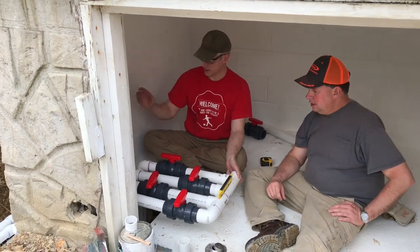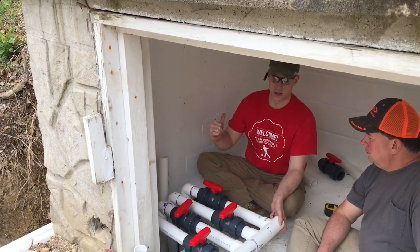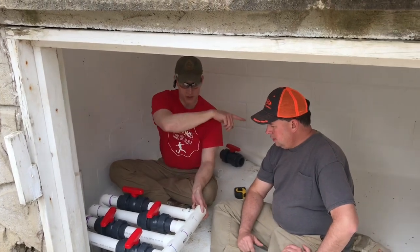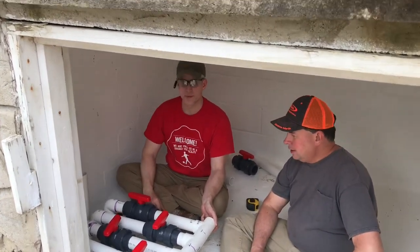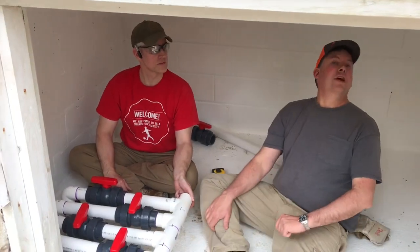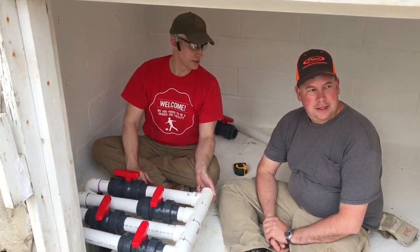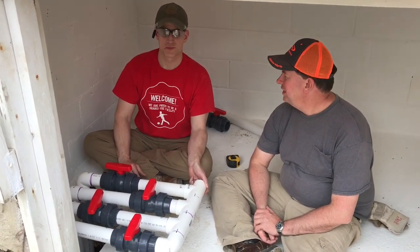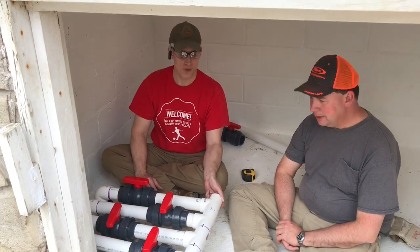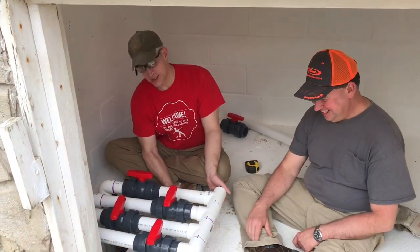Next we've got to get the vacuum line, the main drain line, and the two skimmers. They're going to come back this way and hook up with the pump and get sucked into the filter, and all this stuff will make its way through the system and come back out. We're going to put the equipment along the back wall, as far back as possible so it's out of the way. We've got room for a heater. The sand filter is going to be tricky — we may have to cut a hole in the ceiling. It's a big filter, and this one's a one-piece unit, so we'll stay tuned on that.